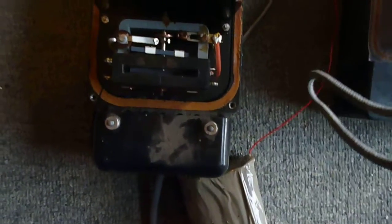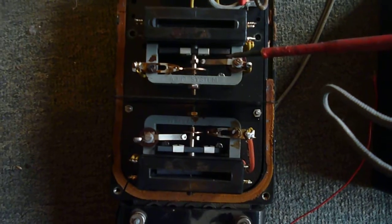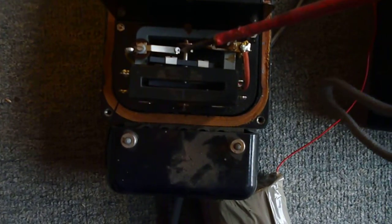You've got two of these pendulums. This one here is for activating this solenoid here, which will then pull this down and allow these contacts to drop closed. And you've got this one here which will activate this other one, putting it in the off position.